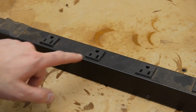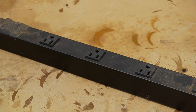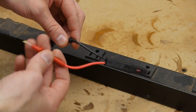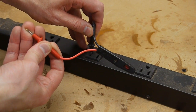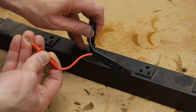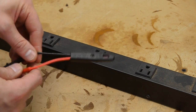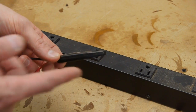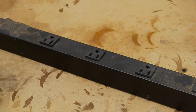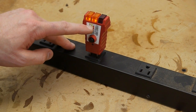You may find yourself needing to know which side of a line is hot and which is neutral — especially with a polarized plug you suspect is wrong, or in an older or unfinished house. Here's a quick trick: with a standard neon tester, touch one side with your fingers and probe each side of the socket. Your body acts as a large capacitor, allowing a tiny current through the tester on the hot side. Remember there's a current-limiting resistor inside — don't try this with a plain neon bulb. For the safety-conscious, plug-in outlet testers also exist that diagnose all problems: reverse hot/neutral, open ground, and more.